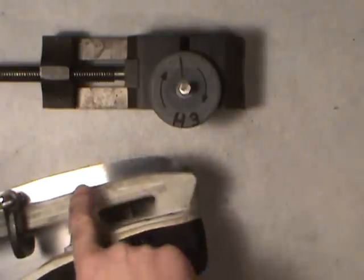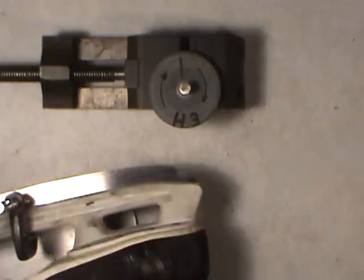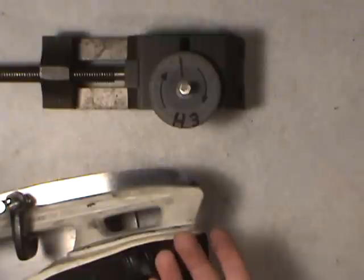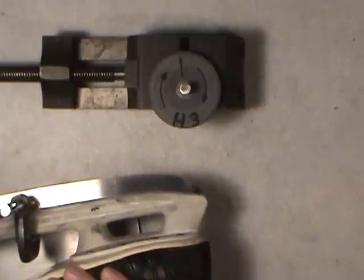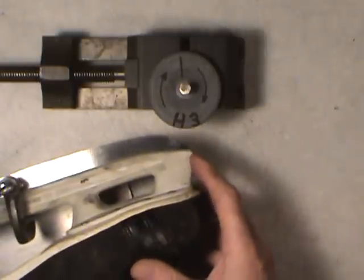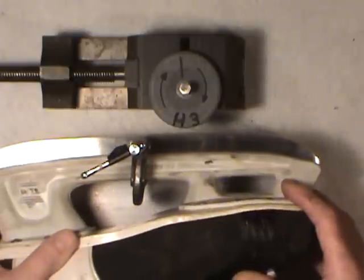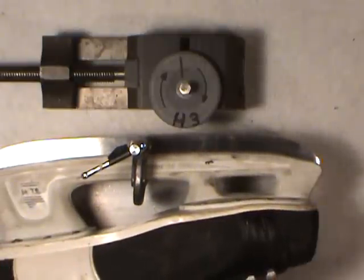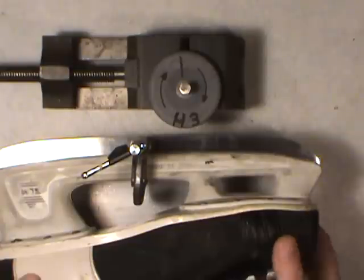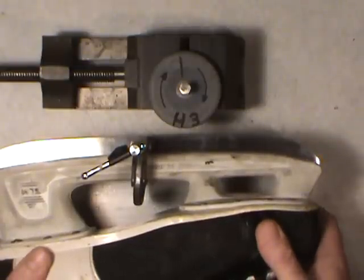It depends, like I say, if the blade is bent the other way, the boot might be this way and I might be sharpening it in the other direction, but I always, as a rule, go from this direction, touch down, just get it sparking, and then follow the contour of the blade and bring it along. My hands are actually underneath here holding the angle iron down onto the table, but for the video purposes I'm going to keep them up top here just for stability